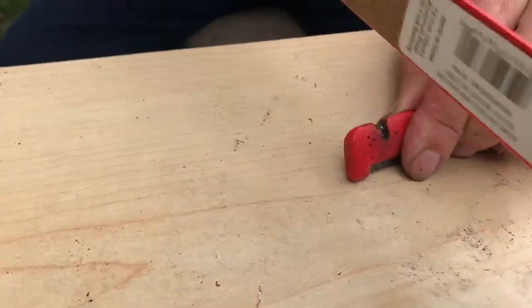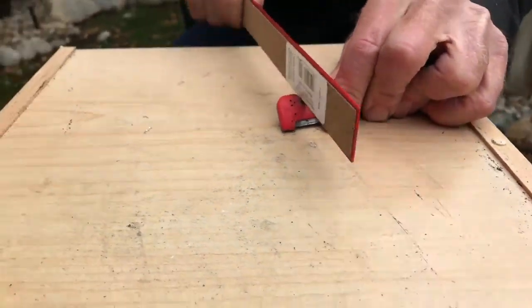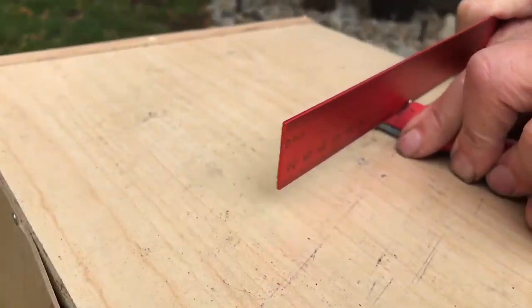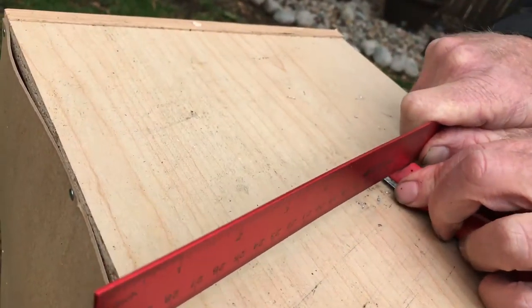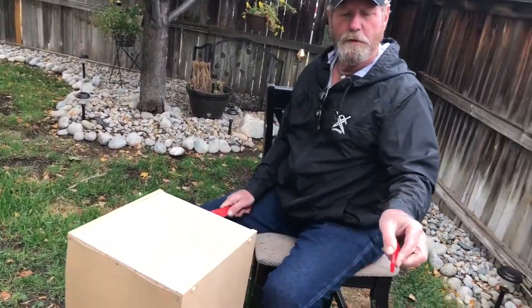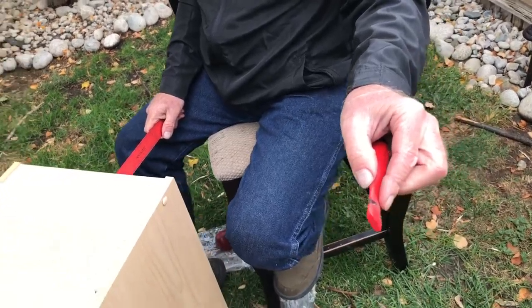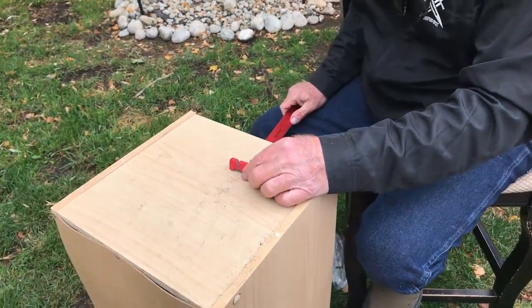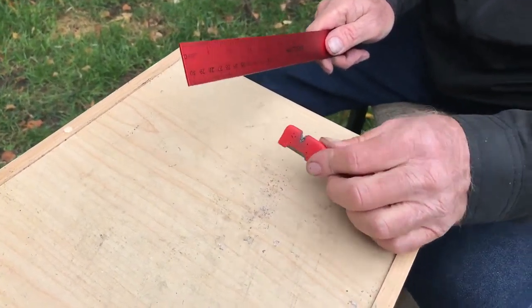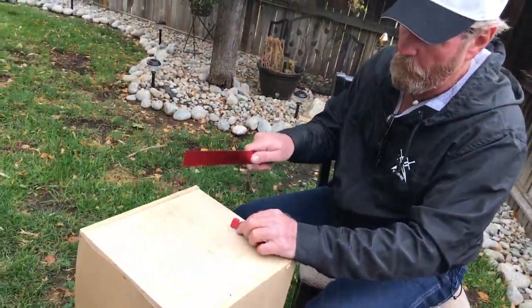Look at the pigtails of metal that come off of there. Now give me a strategy — a certain angle or something you're working with? Instead of having it straight up and down, which would be 90 degrees to the table, I tip it over about probably 25 to 30 degrees, get the cutting edge of the carbide about like this. Straight up and down wouldn't work very well — you've got to tip it over.